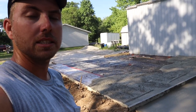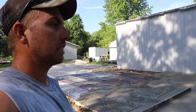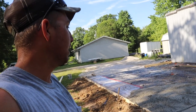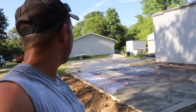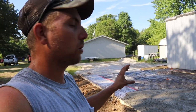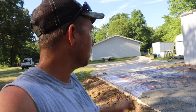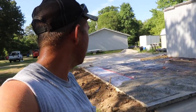Had a little issue. They didn't send me quite the loads that I wanted. I wanted two 8-yard trucks. He sent me a 7 and a 9, so I'm not quite as far along as I wanted to be. So I'm gonna have to pour out, pull them forward, then put my header in. But we'll get it. I'm gonna still be in the shade here for probably another hour and a half, 2 hours. So hopefully that'll work with me where it won't burn up, because it's warm already. But anyway, so far so good. I'm at least ahead of it, so right now I'm feeling fairly confident. Get her done.